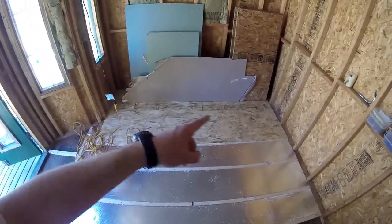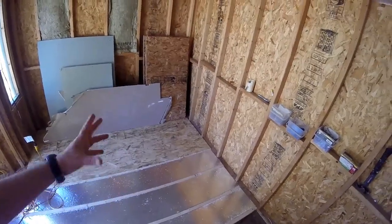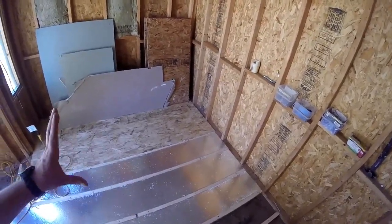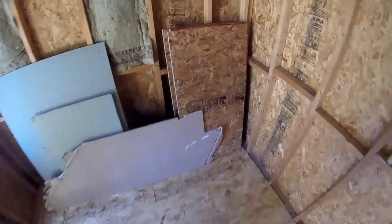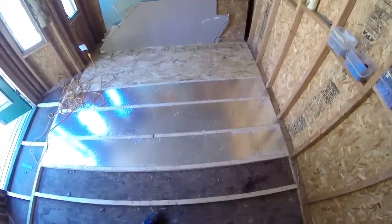Awesome. Now, the one really funny thing is this shed isn't fully square. And I found that out the hard way when I was putting in that first piece of subfloor there. Yeah, it's only 7/16, but I've got my supports basically every 10 to 12 inches, so there's more than enough support on it. There's no give whatsoever. But the strapping works like a treat, and the inch and a half foil closed cell foam is working awesome as well.